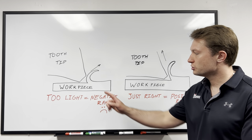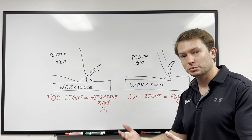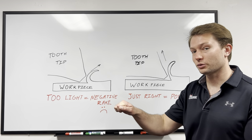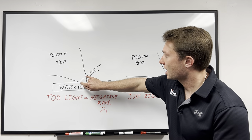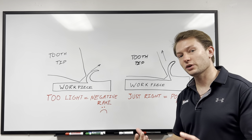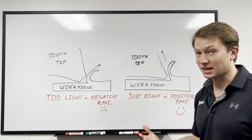And I don't blame them. They're usually cutting expensive work pieces with a generally more expensive blade because it has more teeth on it. The reason that the blade generates a little bit more heat when they aren't feeding quite as hard is that our new 14 inch and 12 inch stainless steel blades have what's called a K-Land. It's essentially a chamfer across the tooth edge. What that's going to do is help you with initial impacts and keep that tooth edge together longer. That's why our blades last so long.